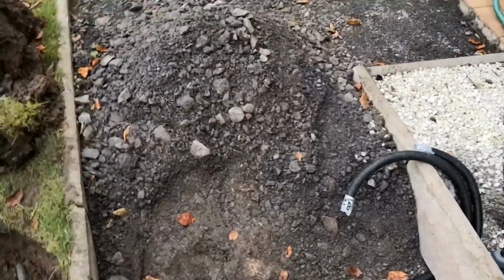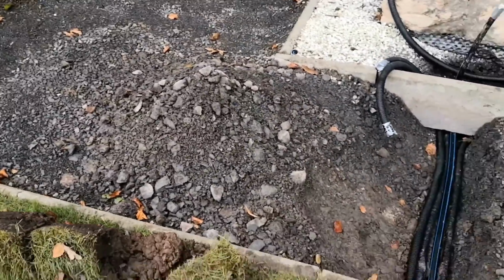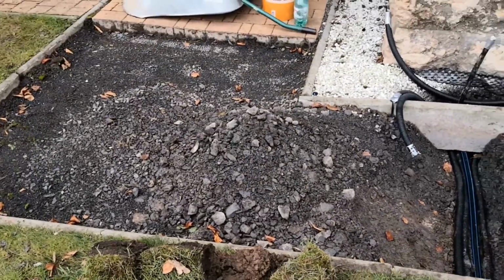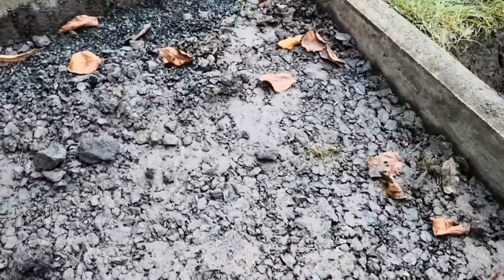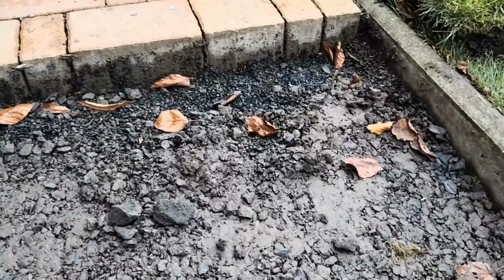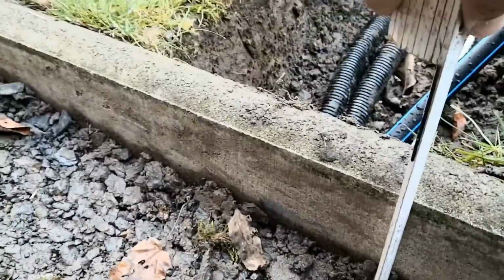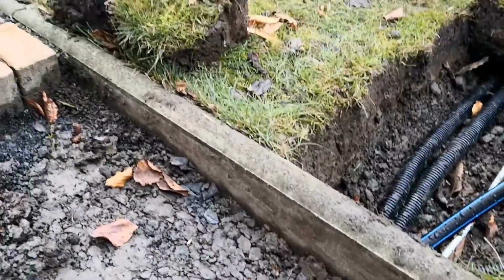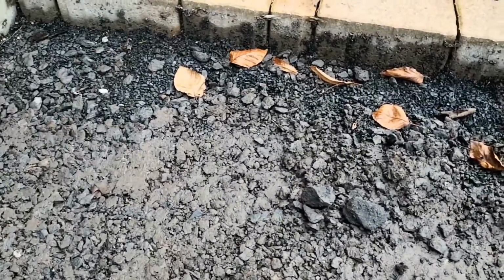Afterwards, the paving stones will be carefully laid again. I will do that tomorrow. It is already too late today. I have carefully filled and thoroughly compacted the substructure, ensuring utmost stability. I have left enough space so that I can precisely lay my paving stones. The stones have a height of 8 cm. I have an average of approximately between 9 and 10 cm of air to the edge, or so. I will now install the gravel, or the bedding gravel, and relay the paving stones.